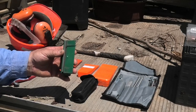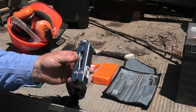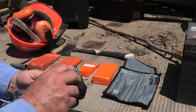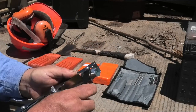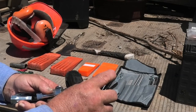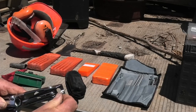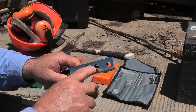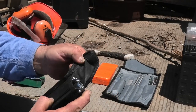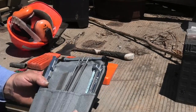This gadget is to dress your bar and keep it nice and square so your chain runs true. This is a universal spanner from Jono and Jono that fits just about everything on your chainsaw. It has tube spanners for your bar and spark plug, a gauge to check what size file you've got, allen keys common to most chainsaws, screwdrivers to adjust your carburetor, and a raker hook to clean sawdust out of your chain bar. It folds up into a little pouch with a belt loop — really handy if you're just going down the paddock to cut firewood.